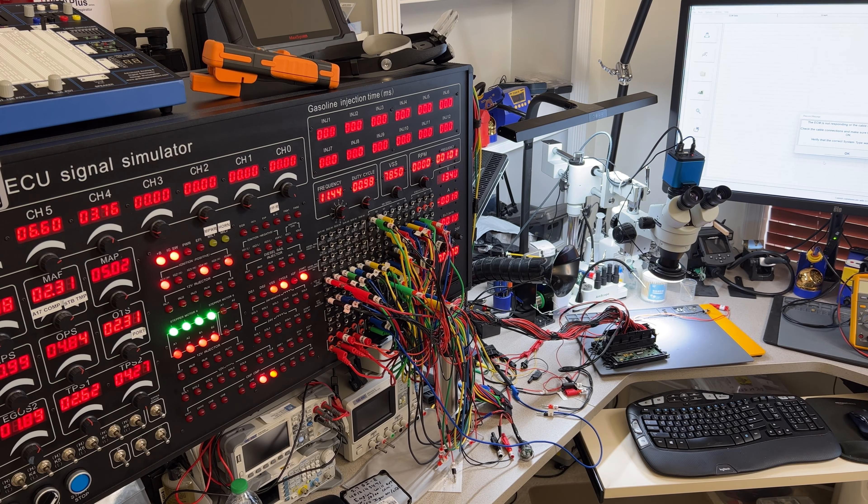I'm going to bring this down and try to connect the computer. I'll turn the ignition on — you can see it's at zero amperage, everything is connected. But when I try to connect to the computer — it's a Volvo Penta — there's nothing. I've already supplied cam and crank signals, and absolutely nothing happens.